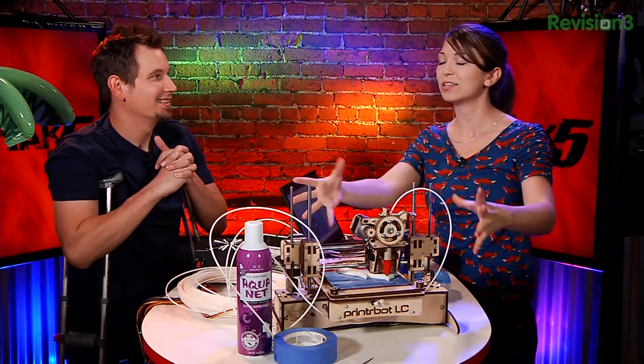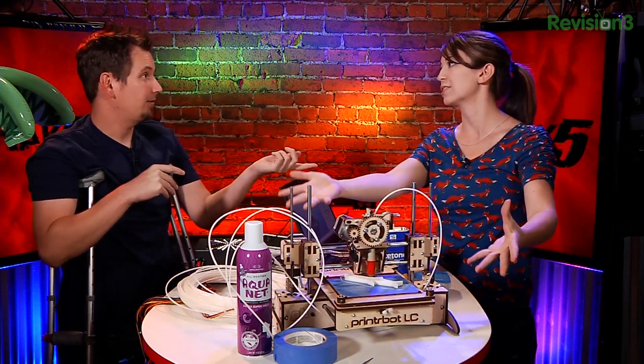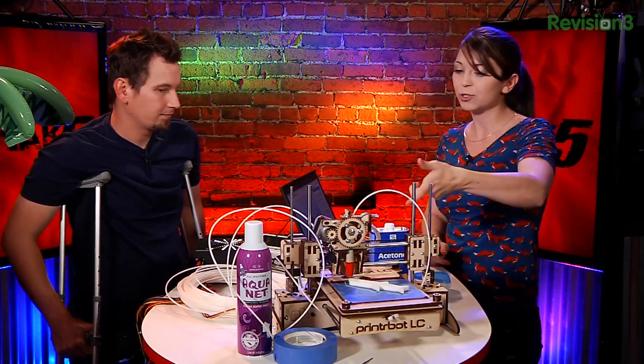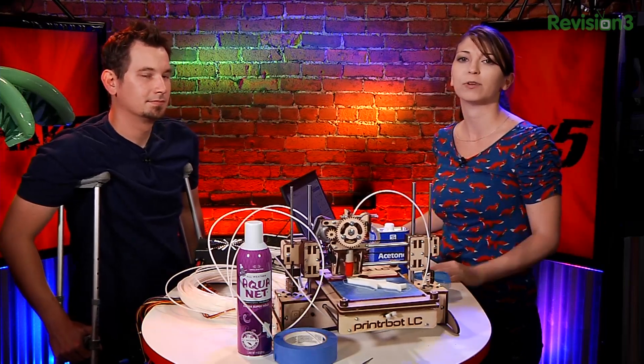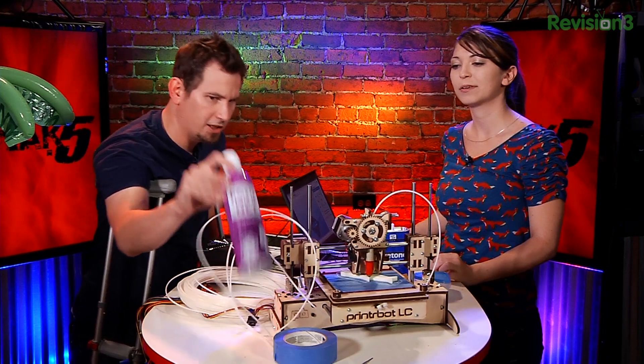You could put this in some sort of bubble enclosure. That's why they sell insulated boxes — like what Dave Randolph does for the MakerBot with those window panel enclosures. So try a different power supply, make sure the thermistor is working, and you can also verify the correct temperature with an external temperature gun — just aim it with a laser at the bed and make sure it's reading correctly. Those are pretty cheap to buy.